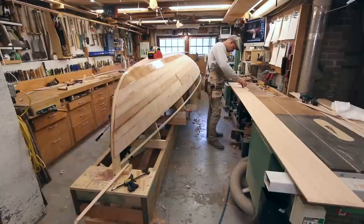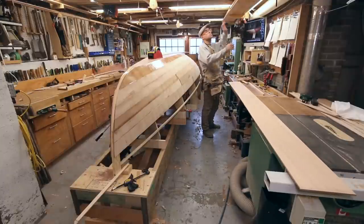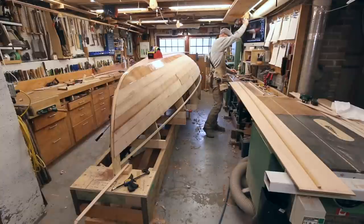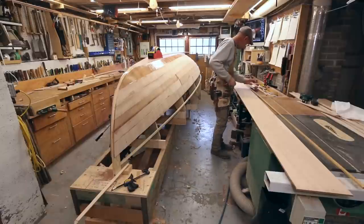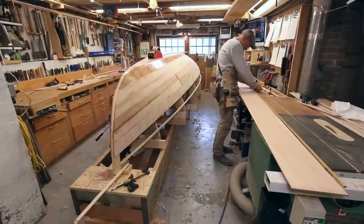A well-prepared boat shop should probably have a good variety of battens sized incrementally. So maybe you have 1/2 inch, 5/8, 3/4, 7/8, 1-inch battens, each one representing a different potential stiffness that you might use in the course of building boats. So normally you'd see me doing this with finishing nails, of course, but we're just gonna try and whip it off without finishing nails, just by springing to our points.